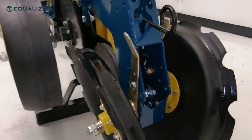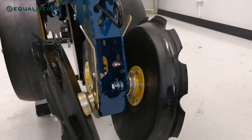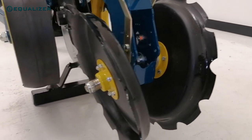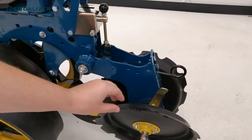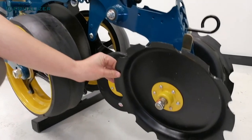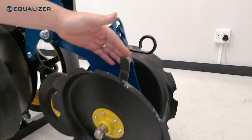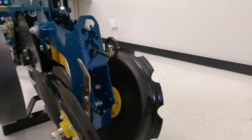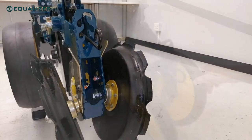As for the closing wheel system, we can offer the following options. Our standard closing wheel option on the SL planting units is the new double V steel closing wheels. These closing wheels have a flat surface to ensure that the seeds are properly firmed, and a notch-colter lip that cuts into the top soil to control the soil flow. These wheels in combination with the adjustable angle of the closing wheel fork help to rebuild the seed furrow and ensure a very even surface finish.